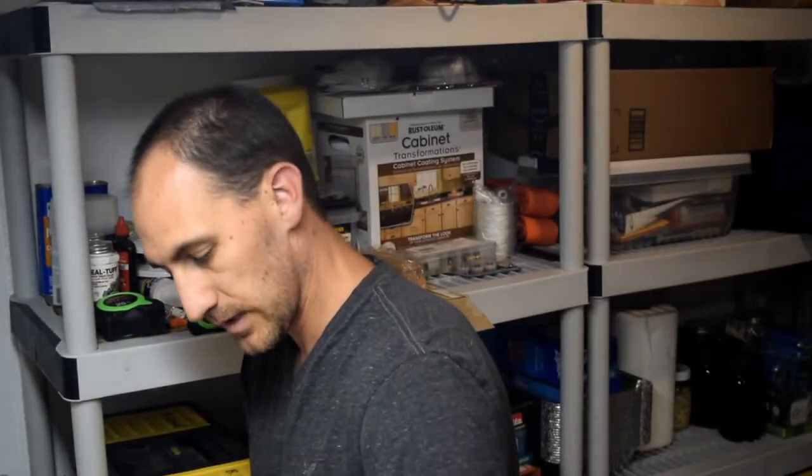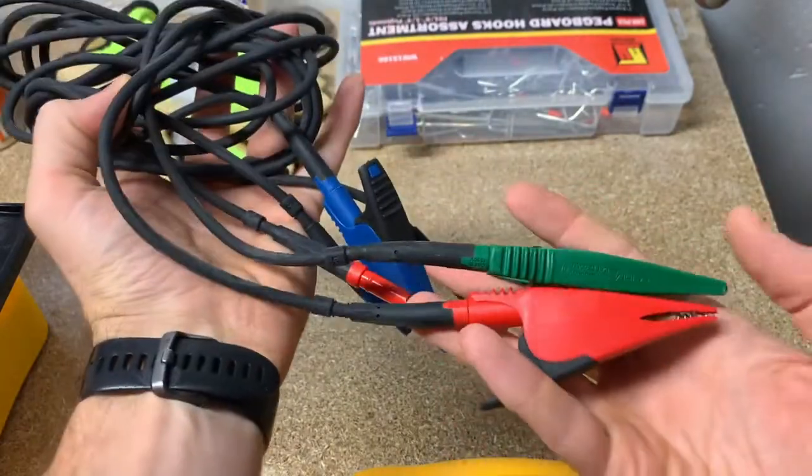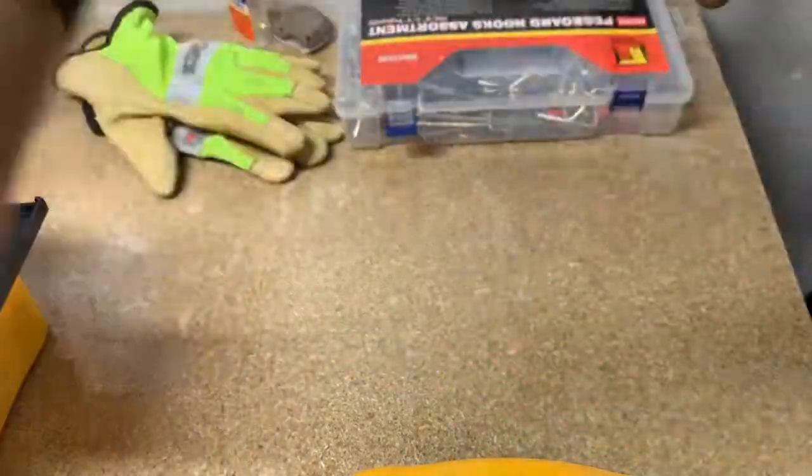You've got various different kinds of outlet adapters based on where you are in the world. Obviously I'm in the US, so this is what we're going to use today. This test lead looks just like the ones that come with the 1500 series of installation testers — whether it be the 1587 FC, 1507, or 1577. All of those come with this little test button you can push to activate the insulation resistance test. It also comes with a set of three leads that allow you to take measurements on wires that don't have a plug attached yet. The real value of this tool, from what I understand, is if you're an inspector or commissioning a building — you want to check all your outlets, make sure GFCIs are checking out, outlets are wired correctly, and you want to do an annual inspection.